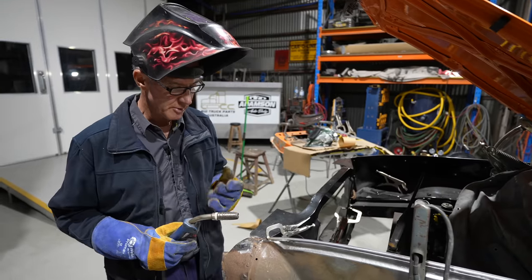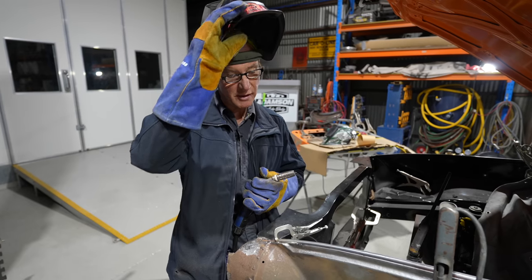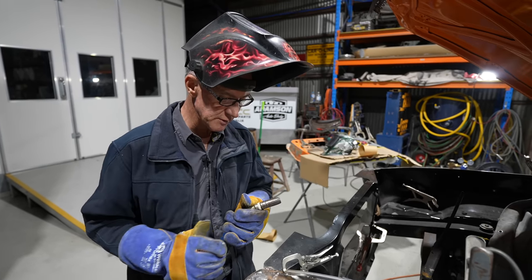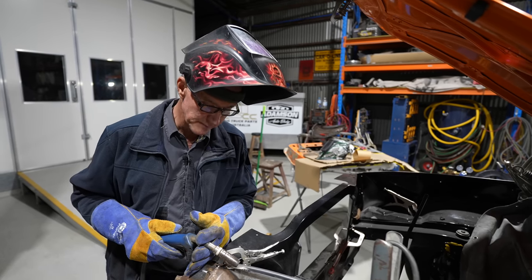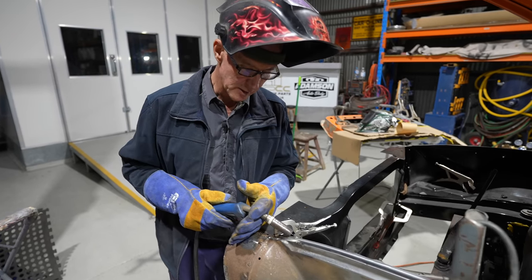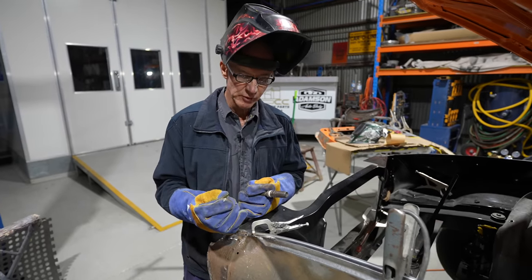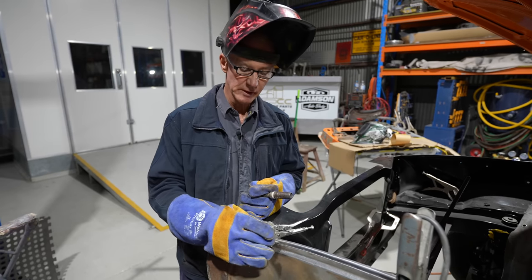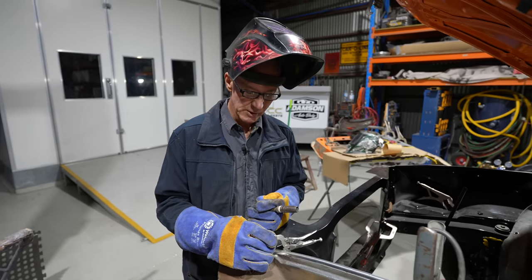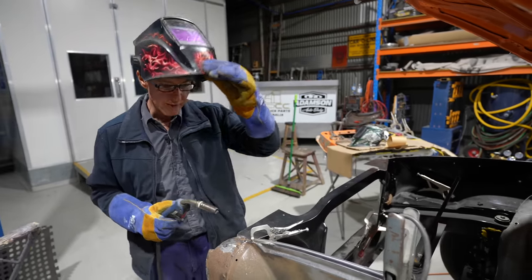But now, you've got to not get complacent when you go to do these welds. It's easy to do, you can be talking away and you forget where you're at. Just a little tack, and you vary. Don't just get on the one spot and think, oh, I'll just fill that in. Just be mindful and go, I'll give it a tack, move along somewhere else, let it cool a bit, come back and keep working backwards and forwards. Because if you don't, before you know it, and it's not even a mil thick a lot of this sheet, by the time you give it a couple of welds here, a couple there, that thing's becoming alive, it's becoming hot. So always remember, your heat's very, very important, but you've got to have the penetration at the same time. So we'll give this a couple of spots.